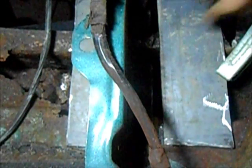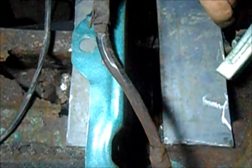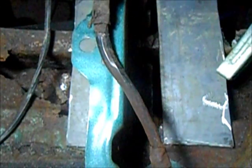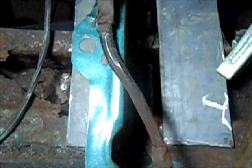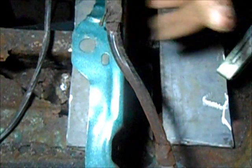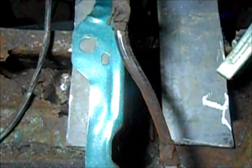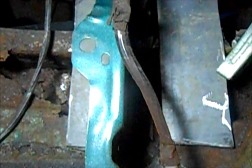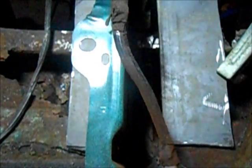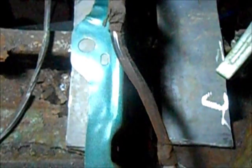Okay, I cut the steel for this side. For now I'm just leaving a little gap here — I think the spring sits on top of that anyway. When I get to finishing the floors, I'll reinforce that better. I really just don't feel like taking that out, although it would probably make it a lot easier. Time-wise, I'd rather not deal with it today. So yeah, we're going to weld this in now and then the driver side will be done.